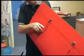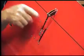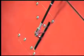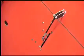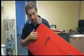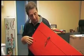I'm running Seacraft arms on this, nice alloy ones with 3mm ball links, and I'm using a clever system at this end, which is pushed through the aluminium here. It's absolutely slop free, and it's a very powerful system. It works quite well. You could run this with 2 servos easily without too much trouble. You could get away with 2 15 kilo servos, no question at all. This is a little bit simpler, which is why I opted for it.